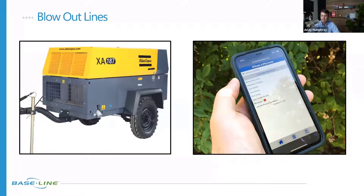Once you've got your last zone and you're blowing mist through there, you've got most of the water — maybe 90% — out. You're going to shut off the compressor, then shut off the zone. We don't want to leave compressed air in there. Shut off the air source, then shut down the zone.